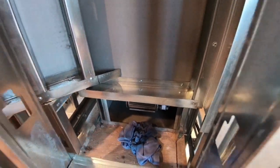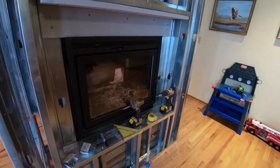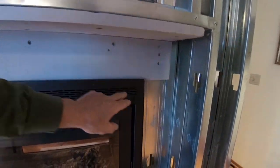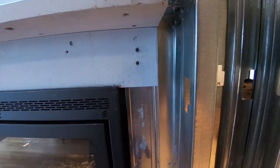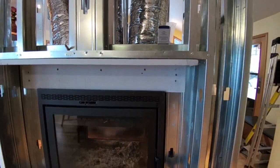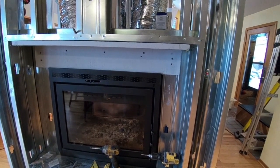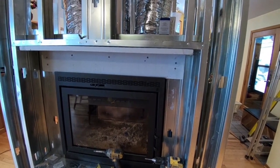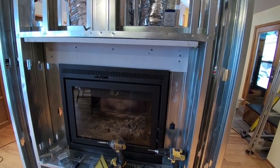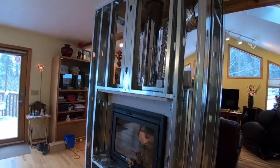I just need to be able to put some sheet metal in there and have something to screw into. Other than that there's nothing screwed to the fireplace other than these panels, and they float — they're screwed to the framework. Very important: if you screw into your fireplace, you could have an expansion and contraction issue where the fireplace heats up and then starts making a booming noise. Not something you want to have happen.